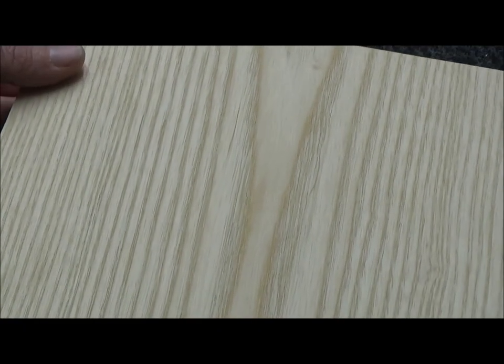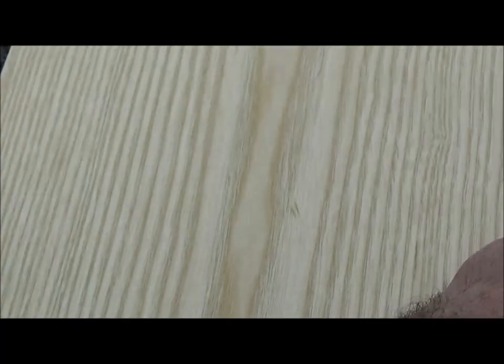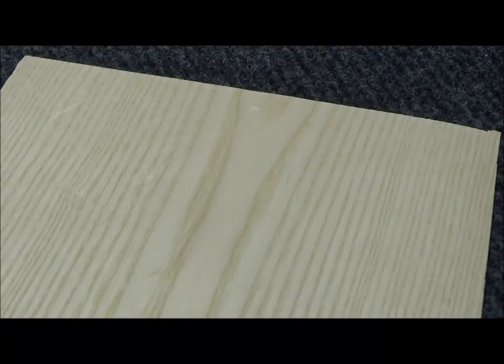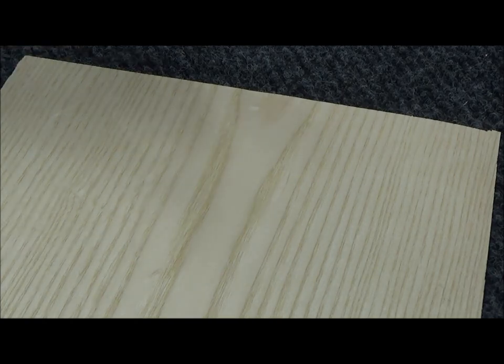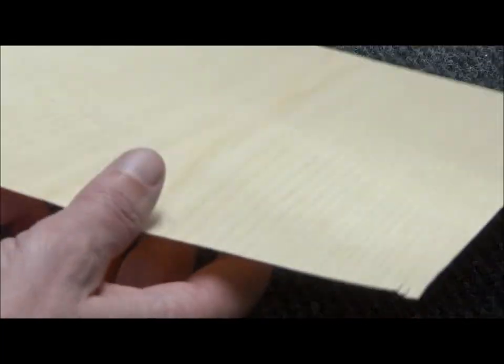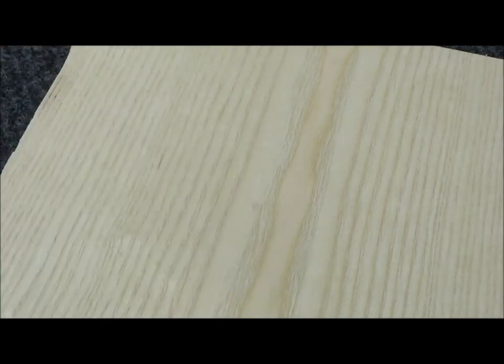We also have to consider which way we're going to orient it, this way or that way. If there's a grain runout that will happen, you have to look at it with backlighting. And we'll look at the body of the guitar with the same backlighting, and we'll determine which way the grain is running out. That way I insert the donor piece in the right grain runout direction.